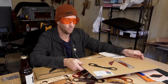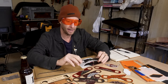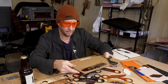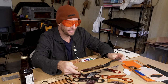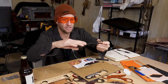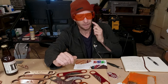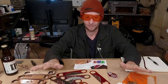This is actually a textured acrylic — it's just black on the back and it's definitely not see-through. This was the second thing I tried. At 200 speed, 100%, using air for everything — this cut very easily. I'm not sure what I would use this for, but it does have a texture to it, so it's not just flat. Probably my least favorite as far as what I would use it for. I can't imagine making a keychain with it, and it's hard to print on. But I'm sure somebody out there has an amazing use for it that I haven't thought of.